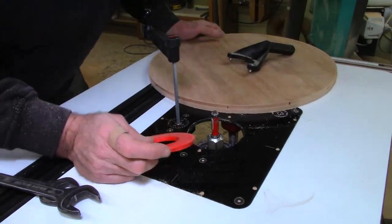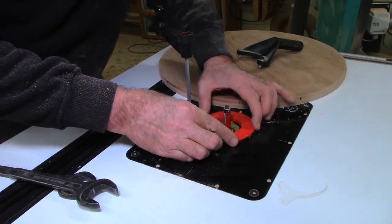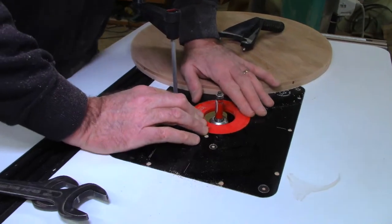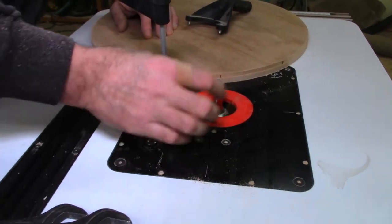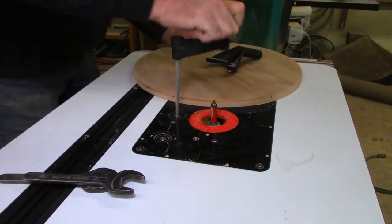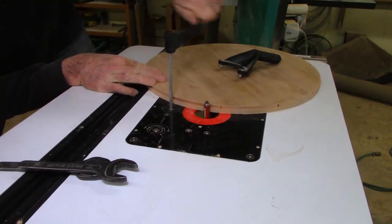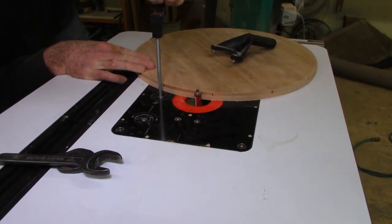Yes. Yeah, so I would normally do that. That's the first time I think I've ever used a quarter-inch cutter to make a circle like that. I just thought it would be fun to make a small circle cutter. But, yeah, the mass of the shank gives you greater stability. And so if you're going to make a heavier cut, you want the half-inch shank for sure. So that's where the vibration question is? Yeah, probably that's the good question, yeah.